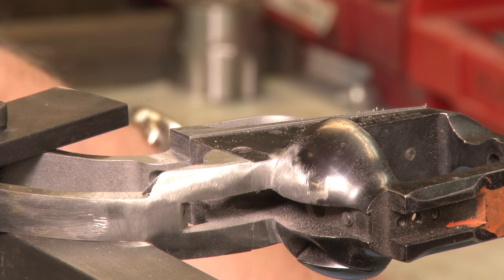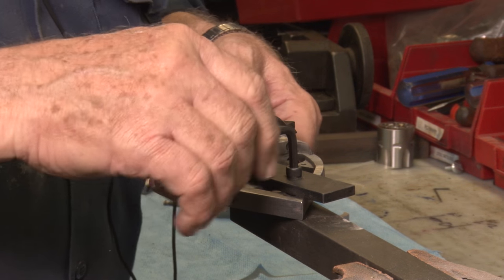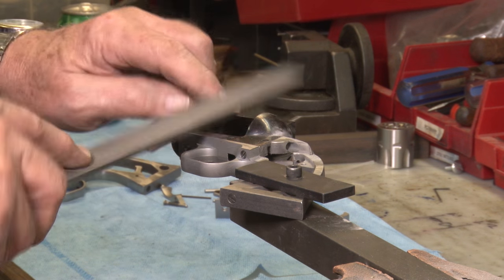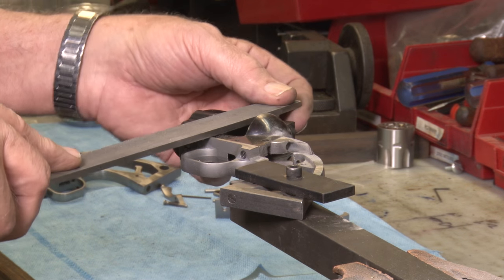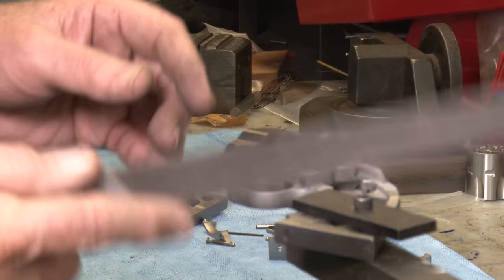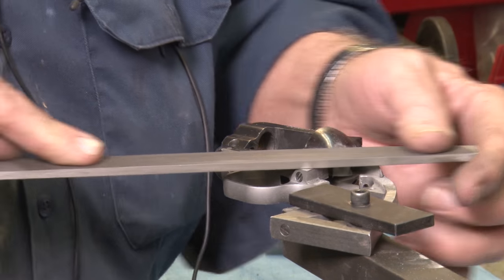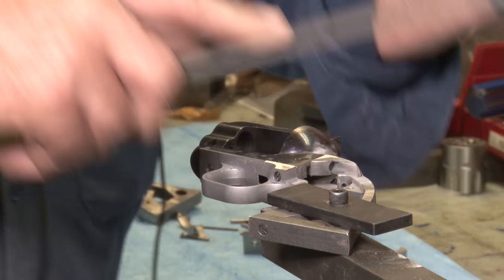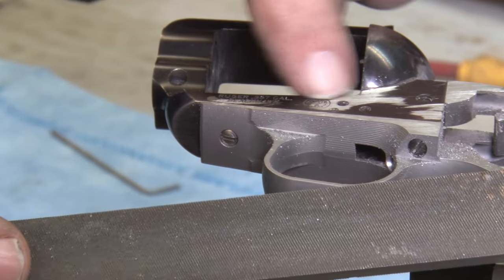There's another thing I do that helps speed it up. Change the filing direction a little bit on this because it's a little easier when you want to take the heavy part of the metal off. Rotate it around like that — this way we can file crossways. You've got to be careful because there's flat with the frame; this is parallel and this is at an angle. So you hit it there and then you drop this a little bit, say five degrees, so you do not touch the top strap. That thins it down to where it's just a few thousandths above the frame. And then you can get this part. Now generally you will mark the frame doing this. But keep this parallel with the flat of the frame — file it down flat just like that. You see, that's about as close as we can get it with a file, taking care not to blemish the marks on the revolver.